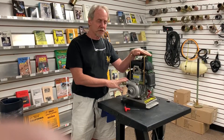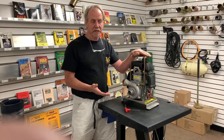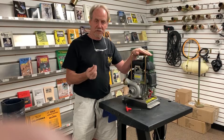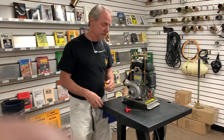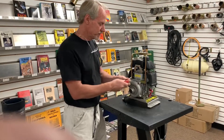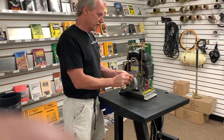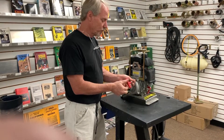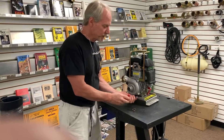A lot of customers who use their pumps in a saltwater condition — we almost recommend that you would take your pump, completely disassemble it, reassemble it, and maybe use some anti-seize on the hardware so you can get it apart when it's time to do some service. It's possible we have some gravel stuck in the impeller, or maybe just a really bad blown seal. That's why I'm going to do a quick inspection of the pump here.